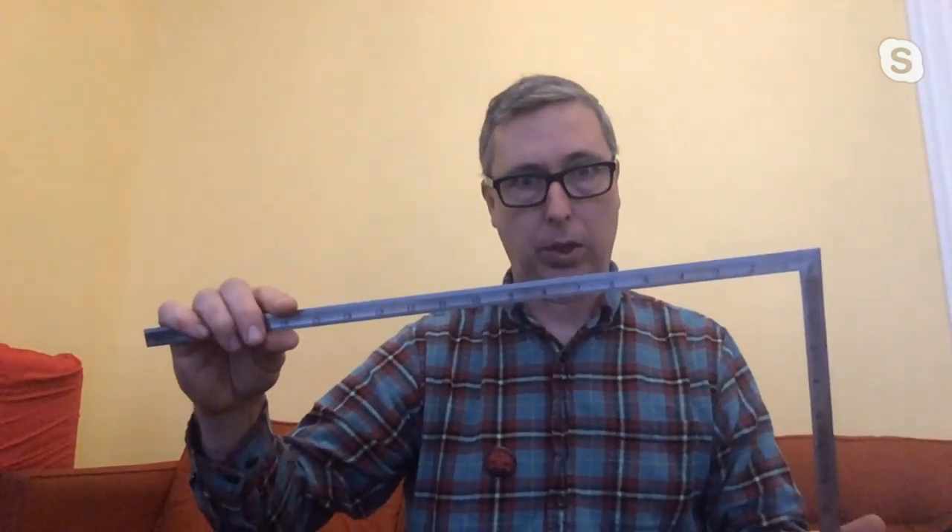So this allows me to go into tight spots — I can go into a window well and kind of bend it into place. This always stays square and straight and allows it to bend, but it never bends the other way because of the construction design. It's got a curvature that prevents it from bending the opposite direction. It's also the way it's made — it thickens at one point, so the flex is only one way. Having both measurements means you have to flip it to another orientation. It can be a little annoying if you're running just inches or just centimeters, but I like the option of doing both. You have the reverse on each side — you can lay it down one way, roll it over to the other side of the beam, drop it, and measure from there.